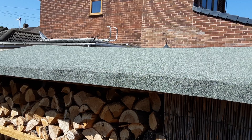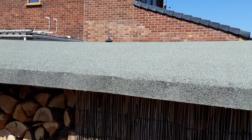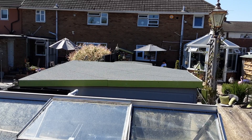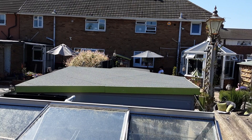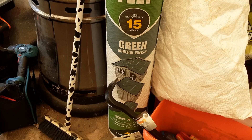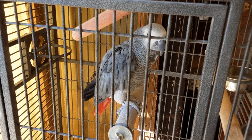We've gone for the most expensive option: the roof cost us £42 for one full roll of green mineral felt — that's the base layer. We'll still have an off-cut that will go along the front. If I have to buy another roll I will, but there'll be no waste because we'll be doing the summer house next — it's due for another lot of felt. Why buy something that lasts five years when you can buy something that lasts fifteen?